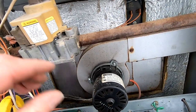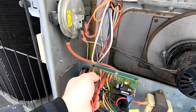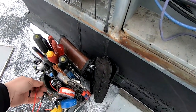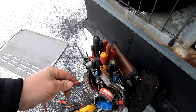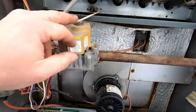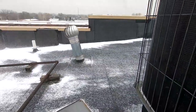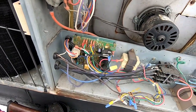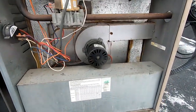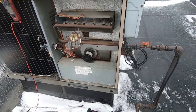I wasn't going to let it run anyway just because that motor does not sound like it's going to make it, and it's too much liability. So we're going to shut the gas section down. We'll leave it so the fan can run so they can at least circulate the heat around. All I did was use a short jumper — and you gotta be careful, that's possibly five to ten thousand volts. We're just going to leave the W terminal off so it can't even run at all, leave the gas valve off, and probably have them order a new igniter too. This is just why you've got to be aware of everything that's going on. It really sucked to get that one going and then find out this one's down too. If you guys like the video, please like, share, and subscribe.